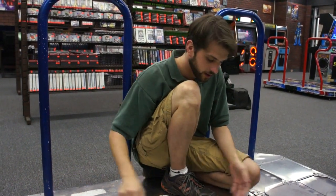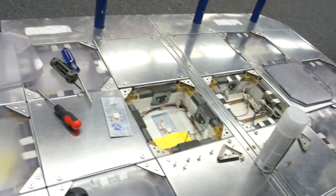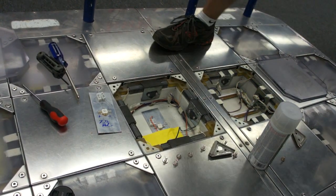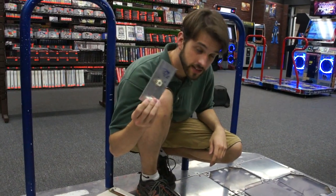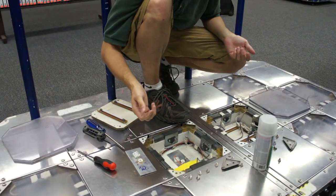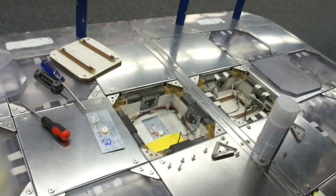Additionally, because the original arrows used CFLs, they really weren't all that bright — they basically just glowed. You could see that somebody was clicking, but it just really didn't have that pop. What we decided to do was switch them out for these 10-watt LEDs from Satis LED. These guys have some kick. We simply swapped them out, soldered some resistors on, used a current-controlled power supply to make sure we chose the right resistor values, and wired them up to the existing system.